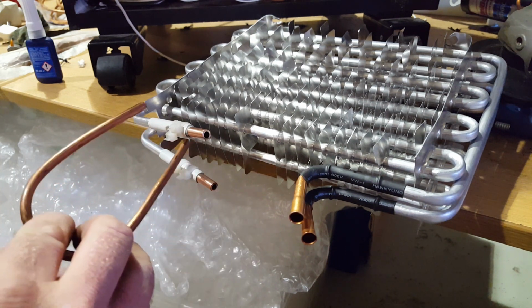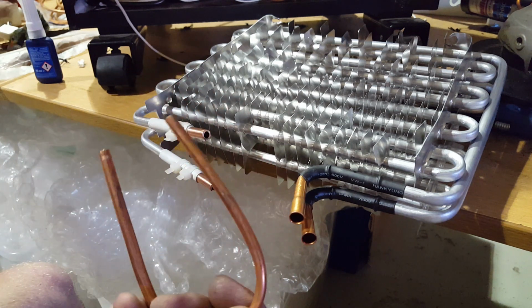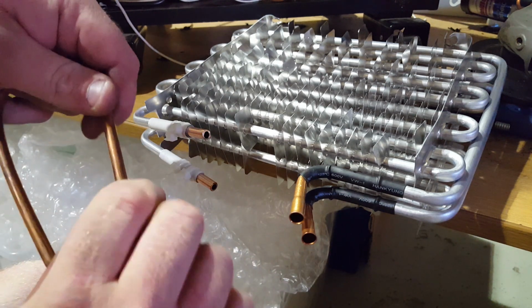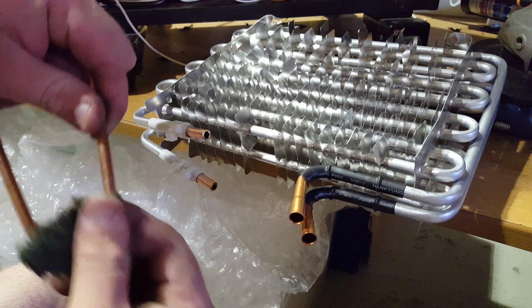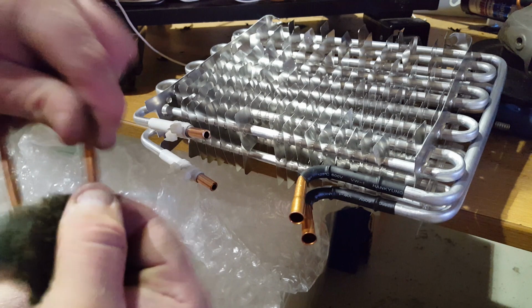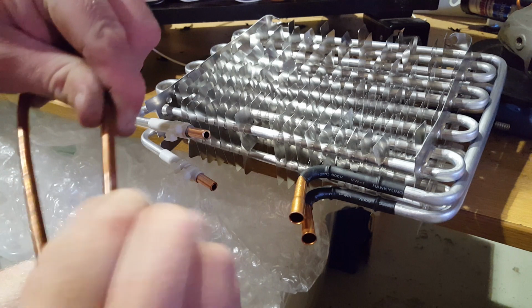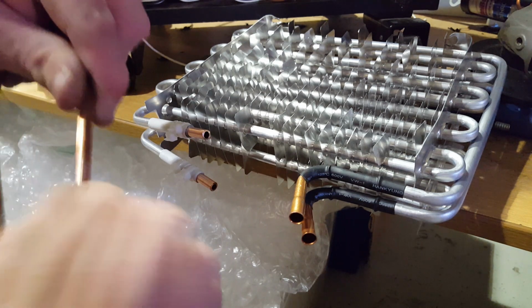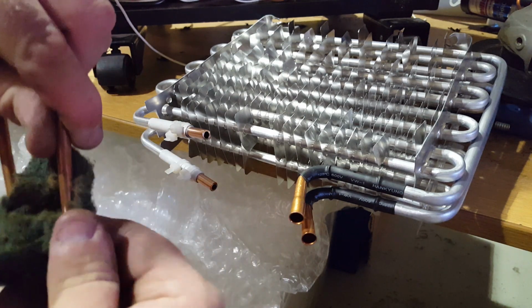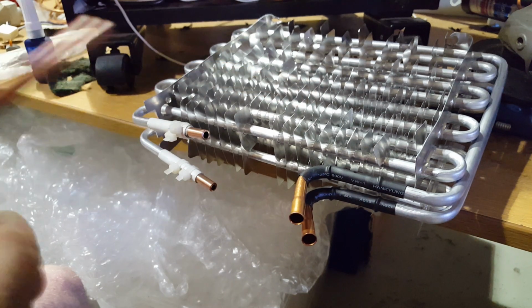Now I'm so close to the soft aluminium weld that I can't braze that now, so I thought it was a good opportunity to show you what lock rings are. And basically, if you're in a place, you notice I've shined them all up, if you're in a place where you can't cause any sparks or stuff like that, lock rings are great. Or if you can't have any hot works going on, you need to make a joint on a refrigeration system, lock rings are there. They're very expensive, but you know, they're like £4 per ring. So yeah, you shine them up like that, and here's a lock ring.